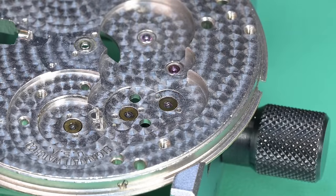We got the click into place, greased a few points, and applied some lubrication to the barrel arbor before we put our ratchet wheel on. Again, we have that square relief cut on the underside of the ratchet wheel — we just make sure that indexes properly. At first the ratchet wheel doesn't want to go into place because the click is kind of in the way, so we pull that click back and the square kind of finds its position and drops into place. We can go ahead and screw this on.